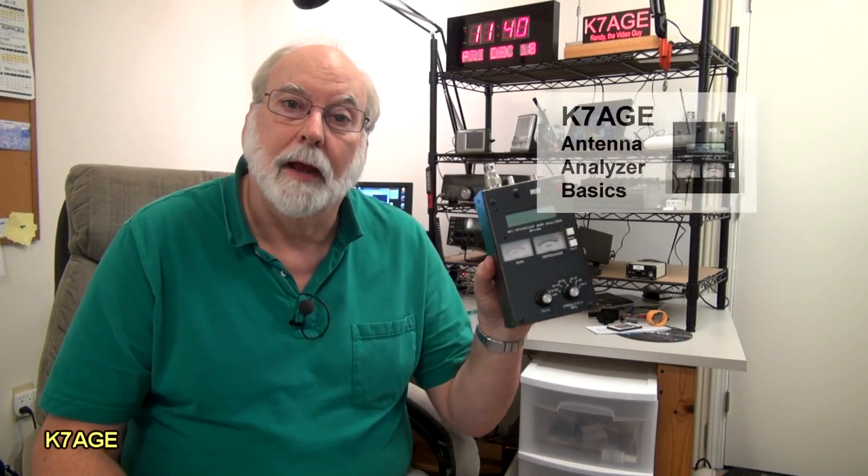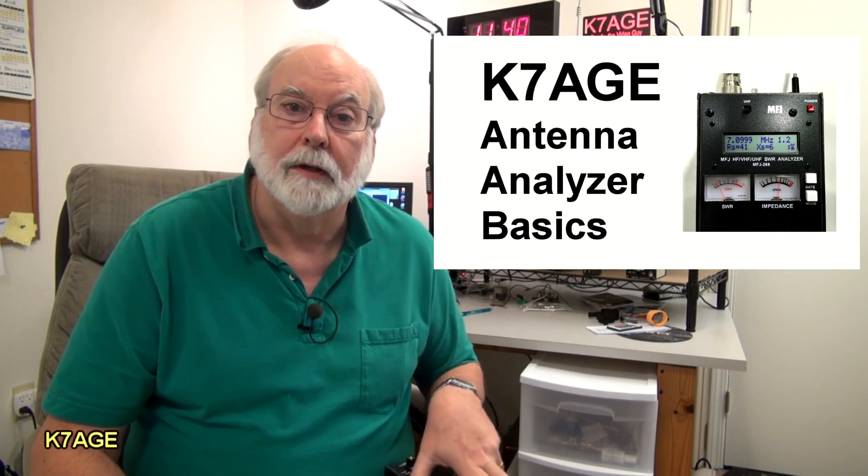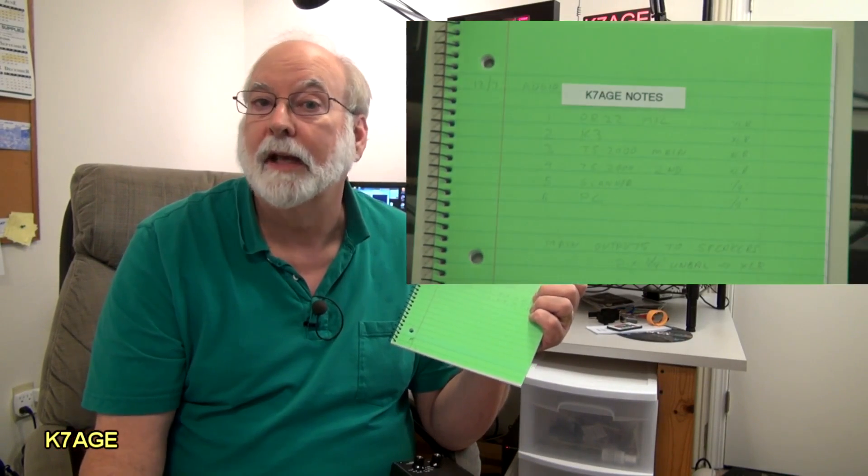I'm back in the ham shack and now it's time to check the antenna. The way I'm going to do that is with the MFJ antenna analyzer that I have. I'm not going to go through all the operation of it — I've covered that in one of my other YouTube videos on my channel. I'm going to record the data measured with the MFJ analyzer in a notebook. It's a good thing to establish a notebook for your station where you can keep track of antenna performance data, SWR measurements, connector pinouts for custom cables, com ports for your computer, and settings for the radio. It's nice to record that so if you have concerns later you can go back and compare what it was originally.